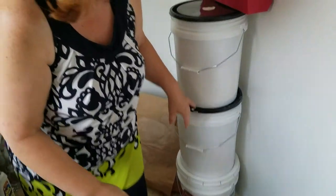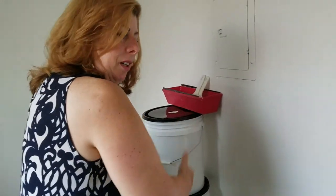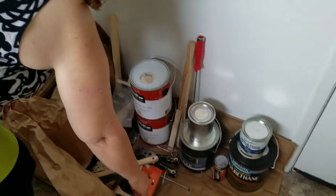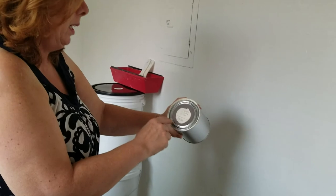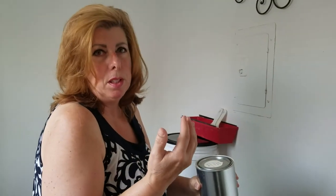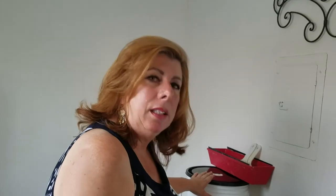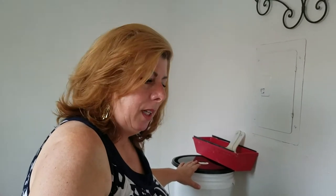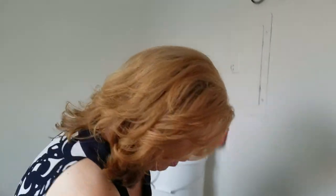I always set up from my starting phase to my finish phase. The glaze is one part paint, one part verathane, and two parts glaze — that's the over-glaze if you run into an issue where it's a little darker than you anticipated and need to lighten it up. Always, when you're doing a texture as a faux, you're going to seal it with two to three coats of verathane. That's why the verathane is in that over-glaze as well — you're continuing to seal the process.